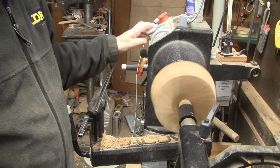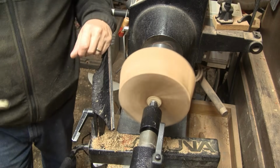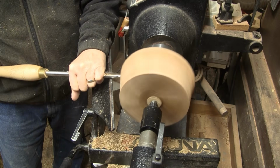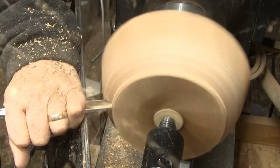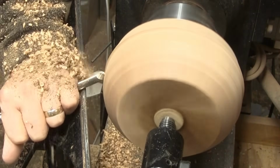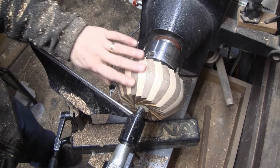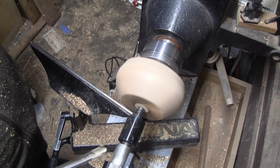And let's see how it runs. Not too bad. Got a 1/2 inch bowl gouge and we'll be turning at 750 RPM. Well, here's a little different angle. I think it looks pretty cool. I'll get that bottom flattened out and that might help me decide the shape a little more. Same 1/2 inch bowl gouge, same 750 RPM.